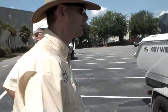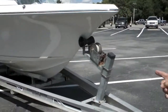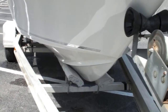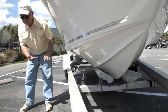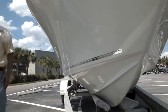Walking around the boat, we can go up to the front of the ridge. Apart from the rather nice lines, we can see from this angle the much sharper entry up here where the boat actually meets the water — the purpose of that is to cut into the water. And from the lower angle, you can see how when that bow cuts the water and the water comes up, it curls back down very effectively in the downturn chine — a very hard chine and downturn chine with a nice gradual curve. Water comes up, throws back down, creates lift in the boat, and keeps the water out of the air. If the water doesn't get up in the air, it doesn't blow back on the passengers. We just came back in from the water and we're dry — and it was a very windy day today.